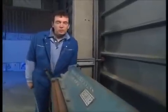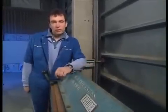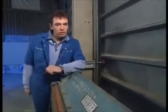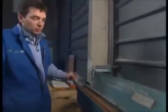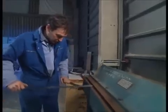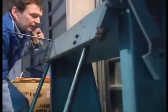This is a bender and it's a serious piece of kit. It is not essential to wear goggles using this machine, but it is essential to have reinforced underwear, because if you stand anywhere near this handle you will get a serious whomping. All you do is open up the jaws, pass in the metal, clamp it with this lever, then pull on the whomping handle and gradually bend this up. It needs to go a little bit past 90 degrees because it will spring back, but not too much past, otherwise it will be difficult to rectify.